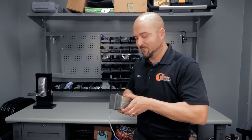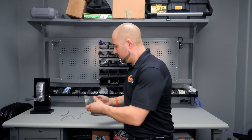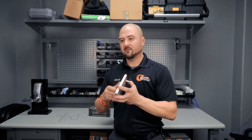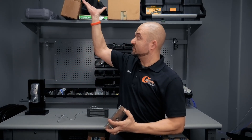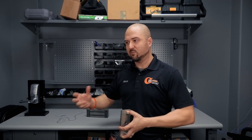You do not want to have your fingers in between that when it does that. How this mounts in the door: basically on the side of the door that's going to meet the magnet, the magnet mounts up to the top of the frame. Sometimes you have spacer plates to bring it down, or if it's on a gate you might have a different type of Z-bracket or L-bracket so that you can mount it.